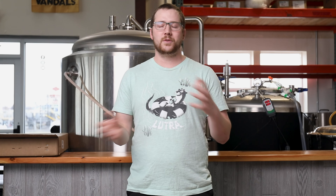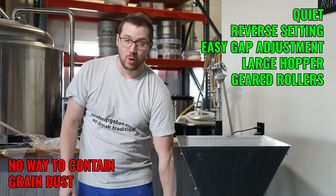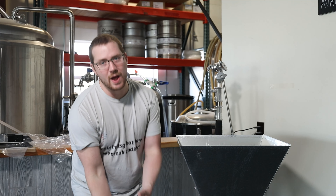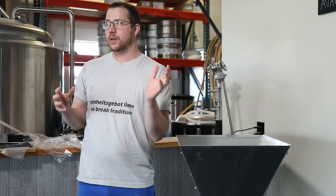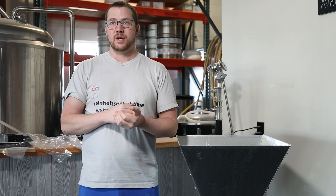It works incredibly well for three to maybe even five barrels and under. Our employees really like not having to mess with independent and dependent rollers — the previous one sometimes wouldn't catch, but this one just runs all the grains right through. To summarize the upgrades: it has a giant hopper where an entire bag of grain fits versus the old 12-pound limit; the geared mill keeps each roller always spinning so it's always grabbing grain; you can adjust the gap on the fly for finer or coarser crush; it's super quiet; it has a reverse setting if something gets stuck; and it has a separator so grain feeds down at a more even pace.